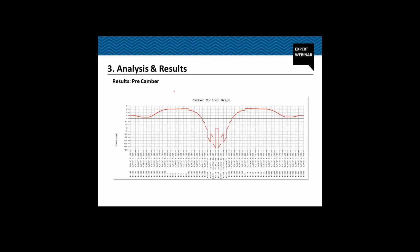Now the effect of creep is actually in the direction of the permanent load. If, let's say, we have a simply supported structure which sags under the effect of all the permanent loads, the effect of creep will be to increase that sagging or the downward deflection of the structure. But if the overall effect of the permanent loads is hogging, that is, it deflects the structure upwards, then the effect of the creep will be to continue the deflection upward.